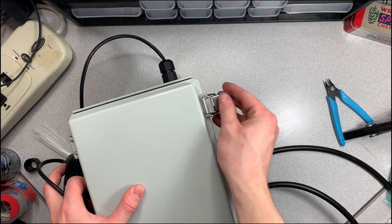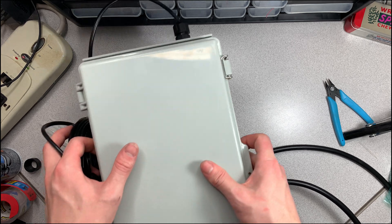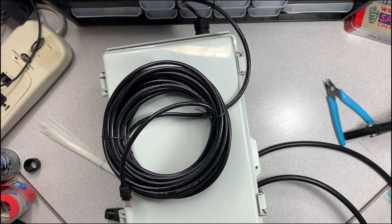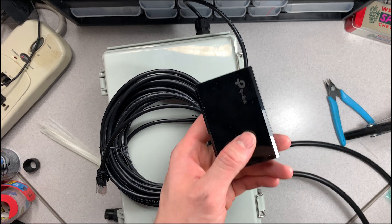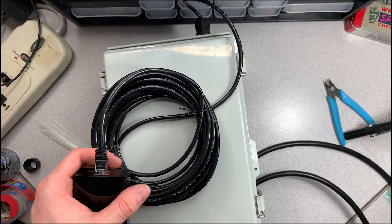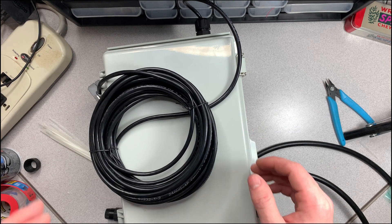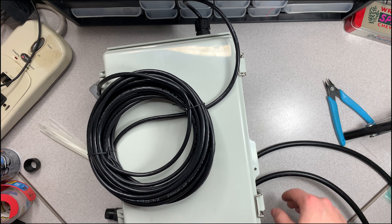Next I'm going to be changing the antenna pole, and I'll make a video on installing all of this. For now, the box build is complete — the parts list will be in the description below. All I have to do is put the clamps on, hook it up to the pole, and run the ethernet cable to the POE injector. It plugs in on the 'power data out' side, then a second ethernet cable plus power goes in the other port to inject everything. I'll only have one cable coming out — I can silicone the hole, add a drip loop, and we're done. See you in the next video!